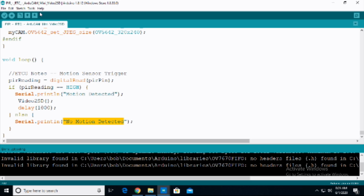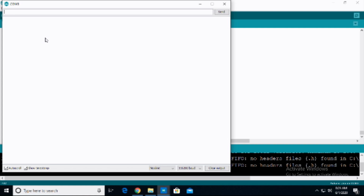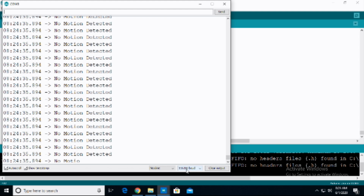Okay, so we now see it's done uploading. We will go to Tools, we'll go to Serial Monitor, and we'll see what it has to tell us. Okay, so the ArduCam has started. Do you remember with this to set the baud to 115,200, and basically I put a little timestamp over here. So do make sure that you've done this.